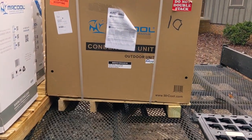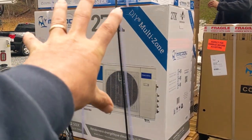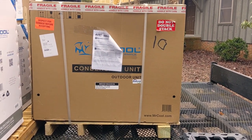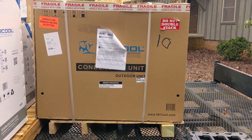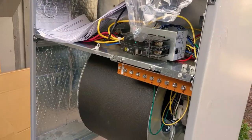These are the DIY kits, but this one is really not a true DIY because of the line sets — we need to flare the ends, pull vacuum, and do it the traditional way. That's why I hired my buddy who's licensed, since I'm not — I just pretend on YouTube.